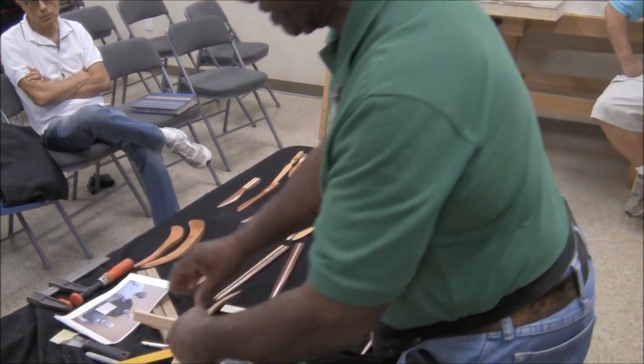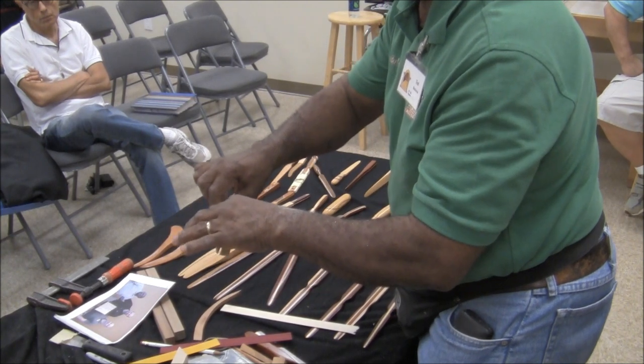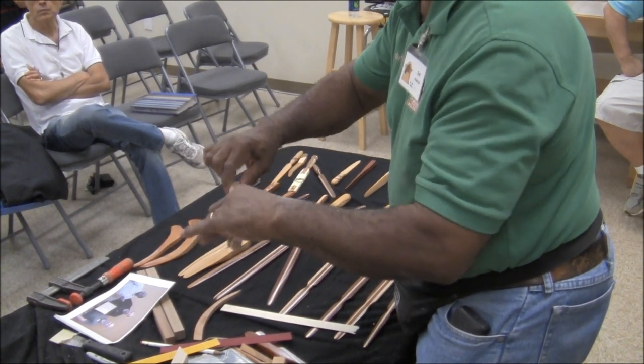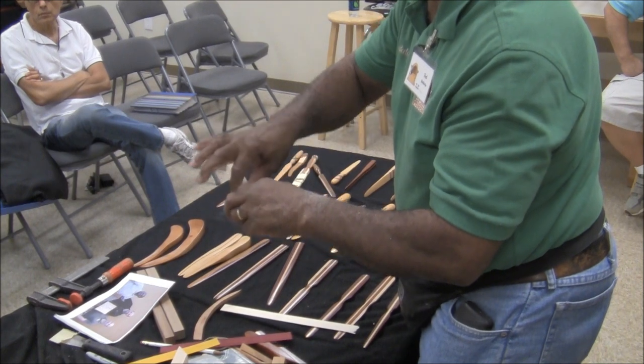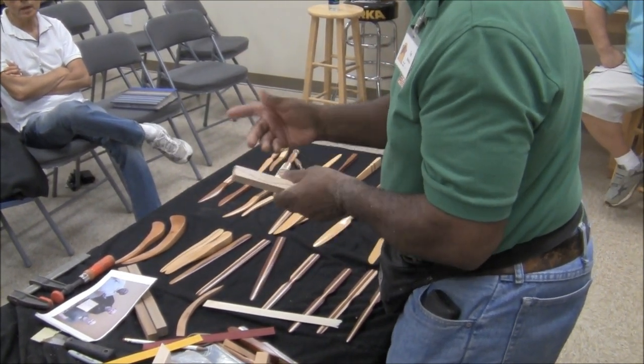All right. You start putting your clamps on from the center, and you don't tighten them all the way, and you work your way out, one here and one going this way evenly. All right, then I'll check everything and make sure everything is lined up and down. Then I start tightening from the center. You have to get used to how much to tighten with your clamps.